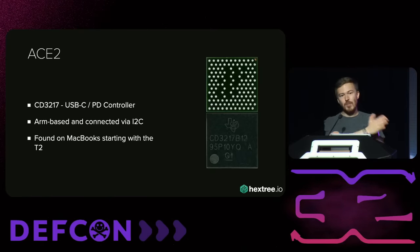Reversing time. It turns out it's essentially the same — only patches get loaded from the external flash. Everything seems to be different on the hardware side. For example, the CRC peripheral is at a different address. And there are some weird regions with high entropy, which is always a bad sign, because that means there's likely some cryptography going on. That will spoil our day if they implemented secure boot. However, some successful things: I was able to reverse engineer the firmware header and found a couple of CRCs. My naive hope was, okay, I just patch the firmware, fix the CRCs, and surely this chip will boot. Let's flip a bit in a $3,000 MacBook.